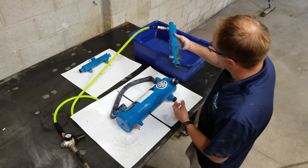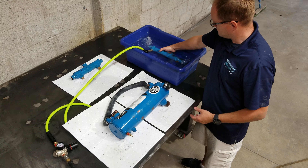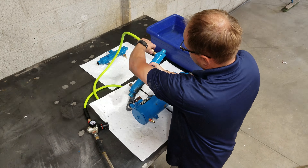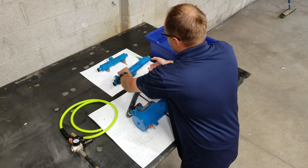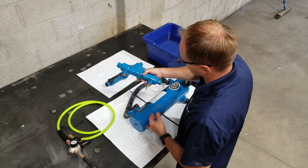Actually right at 10 psi. We're getting air leakage right on the water side of it. This shows us that the transmission cooler on the starboard side is bad.